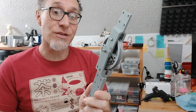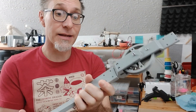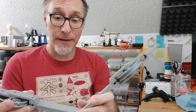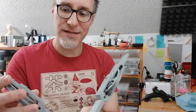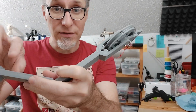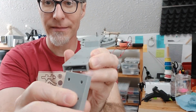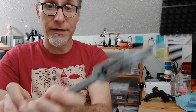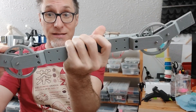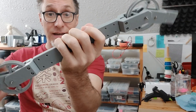This is a cool design that you can download and print. While the build is a little on the complicated side, it is the foundation of how I'm building a lot of my robots currently. I just upgraded this design a little bit — it's a pulley drive with a steel cable, and the steel cables run through this square channel here. You can see them poking out a little bit. When you move one of these, the other one moves, and this allows you to get action at a distance.